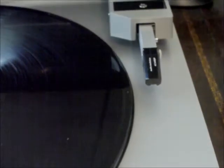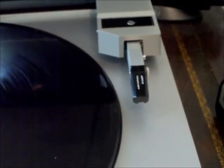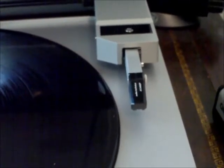The cutting stylus goes straight across the record, and there is a transport system that moves it at the proper pitch. Pitch being how close together the grooves are and how quickly the spiral moves from the outer edge to the inner edge. The normal pivoting tone arm has several things about it that contribute to distortion.